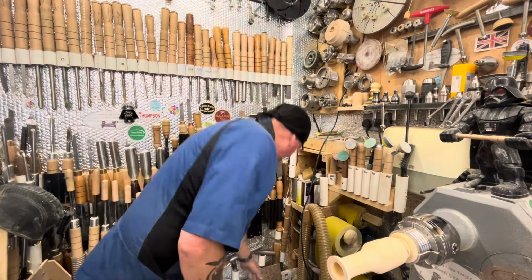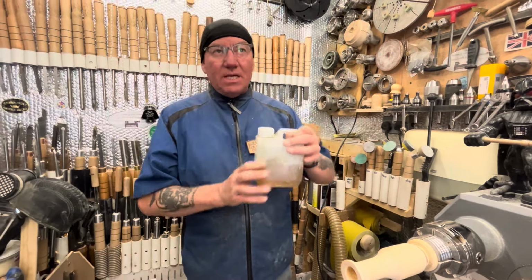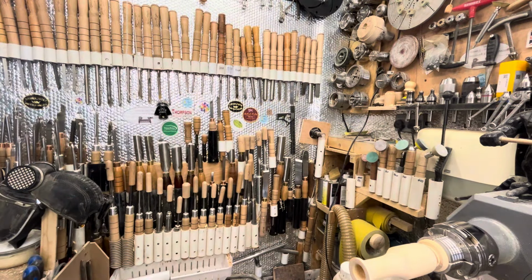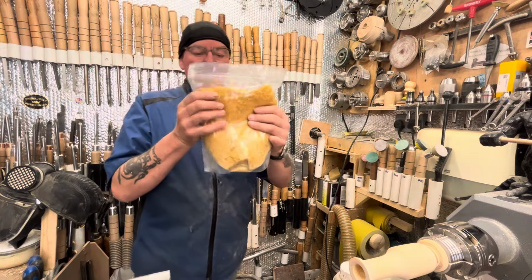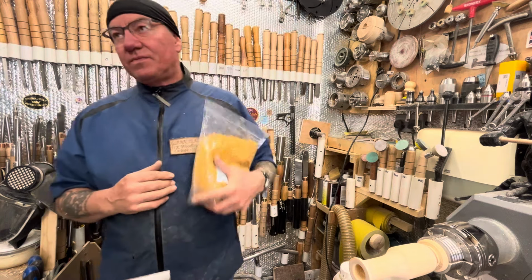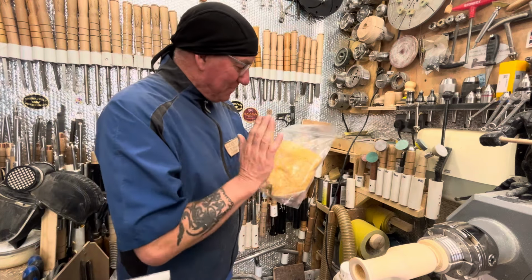Now, when I'm using this mix, I did say sanding sealer was a 1 to 10 mix. That's for the sanding sealer only. Now, shellac flakes, because I've got the shellac flakes, okay, this isn't shellac flakes, this is carnauba wax flakes, but I ain't got any shellac flakes, so I'll change these. It will be like that, okay, all flakes, yeah? I get the de-waxed blonde. I find that I like the blonde flakes because the blonde tends to be a bit thicker than other colours.